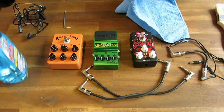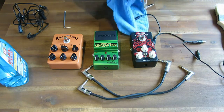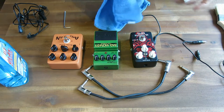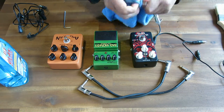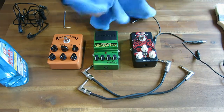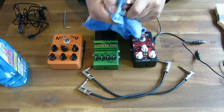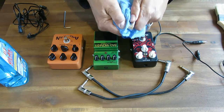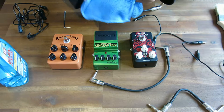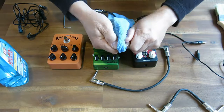You can feel it's wet. I have one corner that's wet and then I'll just go ahead and clean off the connectors on each cable until I can see — try to get right in the bottom there — until I can see that they're nice and shiny. And then I can dry it off with the rest of the rag, since I've not wet the rest of it. And so we just do it with all of these connectors. These I've actually done already. I'll do this again just for purposes of demonstration.